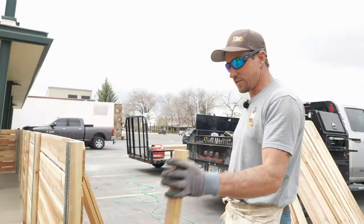The backside picket, because we don't have too much meat, this one right here will catch it. But especially in this corner, we're gonna have to try and guess where those holes are for those screws that we're gonna put in for our cover pickets. So that's why we're not using a nail gun on the backside and we're using screws, because it's a guessing game.